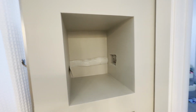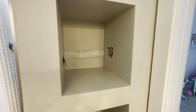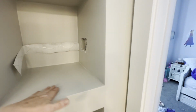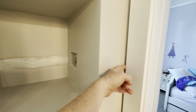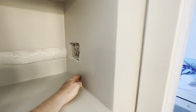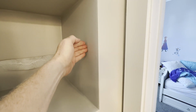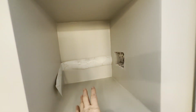The wall covering is 27 inches wide. And it just happens to be that my box is cooperating with the ease of the installation. But let's say I had a 20 and a half inch. I'll come out to here, end up about right here. That becomes a pain, you know? What I might do in that case is start here and come out 20 and a half inches, right? And then deal with this coming over here. I might do that. The whole issue is, can you get your two hands in here and work?